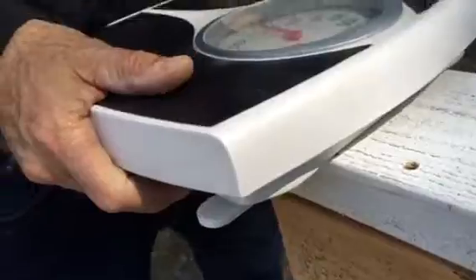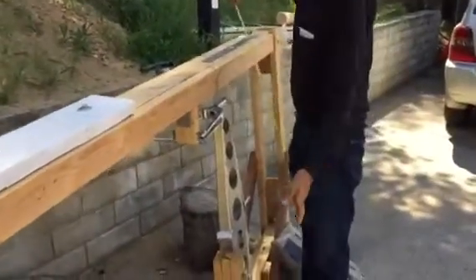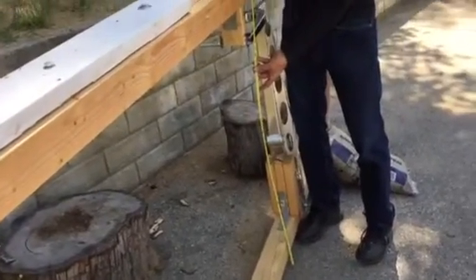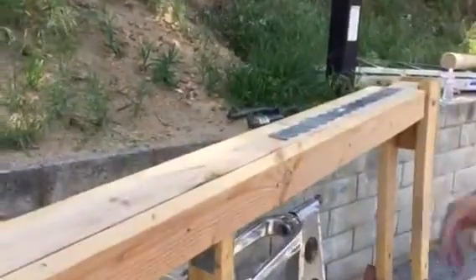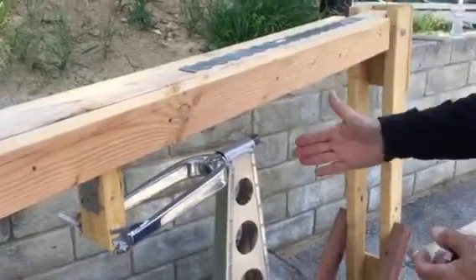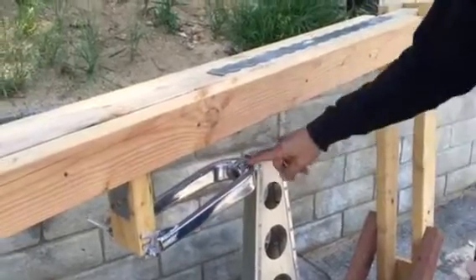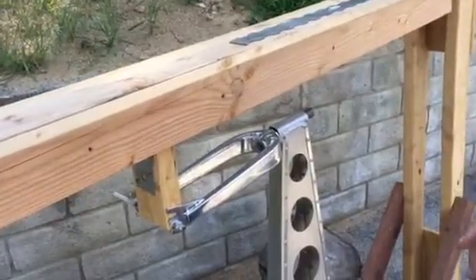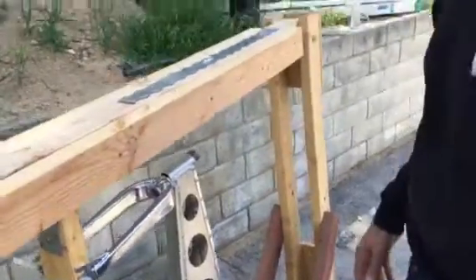You can see I got up to 160 — we'll call it 150 just to be safe. And we will take another measurement here on the fork. 38 inches. So what's happened is the steerer tube has stopped bending. We have another video where it shows a square put here and you can see clearly that the steerer tube has bent. And the fork — these ripples here are from the forming operation, not from any kind of buckling. So the fork appears to have survived a 500 pound load.